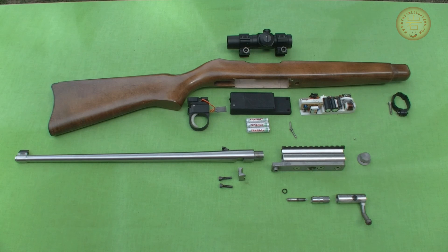Here are all the parts spread out. The barrel is modified from a Ruger 10-22 and mounts to the receiver using a system almost identical to the Ruger. The bolt, which includes the igniter, comes in three pieces and when installed is covered by the receiver cap. Ignition voltage is provided by a custom-designed high voltage power supply, with batteries contained in a separate pack. The trigger closes the circuit, causing a high voltage and high current charge through the igniter and into the powder charge.